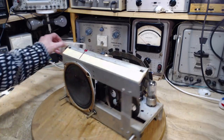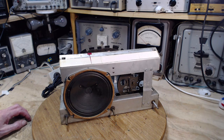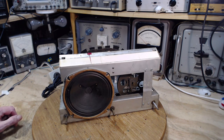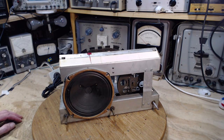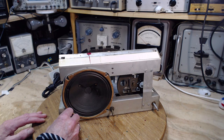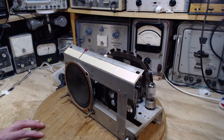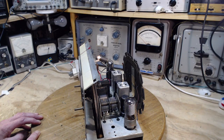That's a little better. So what's happening here is the loop antenna is directional, and if I turn it in a certain direction, it will bring in the signal the strongest, of course. But really what you can do with these directional antennas is reduce the noise in a situation like this. I turn it up a little bit, I just get rid of the noise. So the radio signal didn't get much louder. The noise just kind of disappeared.